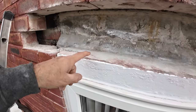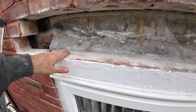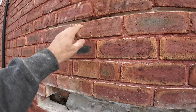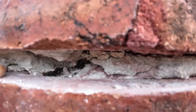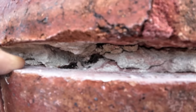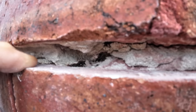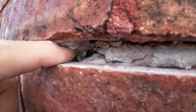Anyway, this bit where it's gone, I reckon it's where the reinforcement doesn't go to the end, and it just took the stress of the bit where it's just knocked it. I don't think it's even dropped, I think it's the tie wires. There's my theory. Proven. That's my theory of the blown tie wires proven, because there's the end of this big fat rusty tie wire.